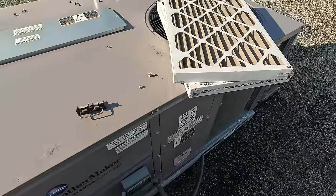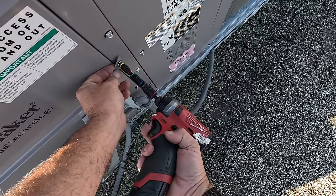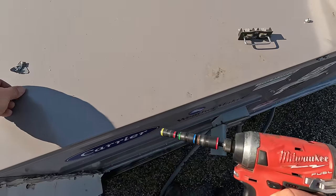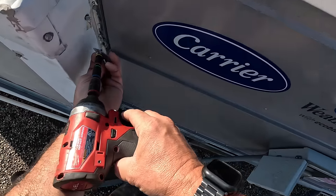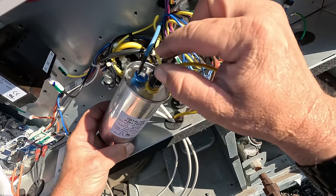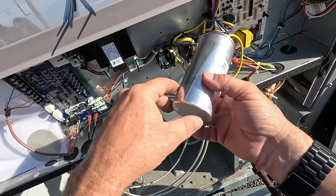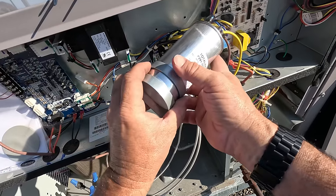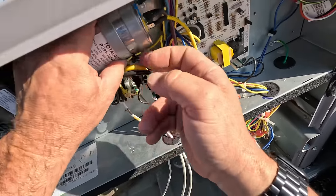I've got to build me a couple of jumpers for the capacitors, which I forgot to grab because I had a phone call come in. I found a bottle of refrigerant up here — I think one of our installers probably left it here, so I'm going to take that with me. Sometimes it can get windy up here, so we'll go ahead and secure things just in case. Okay, we've got the commons all on there, fans back on brown. Look how they made this so brain dead — brown, brown, blue, blue. From Thailand — I'm sure that's better than China. We'll go ahead and get that on there, get that in place, and then we'll mount that other 5 up here in just a second.